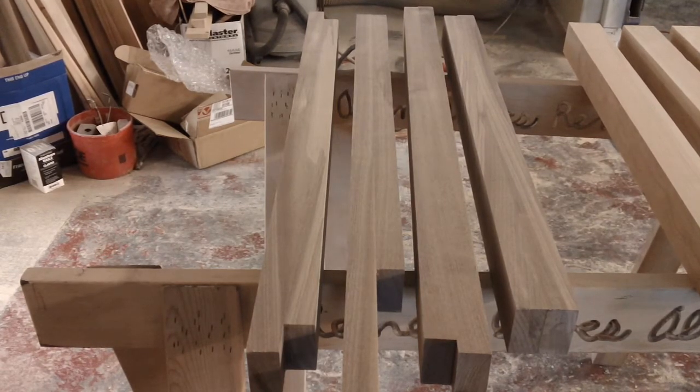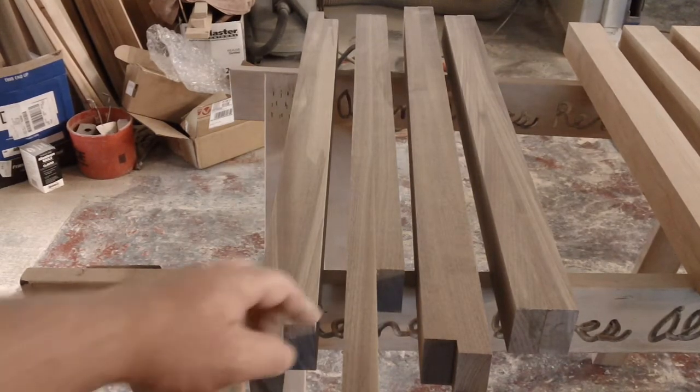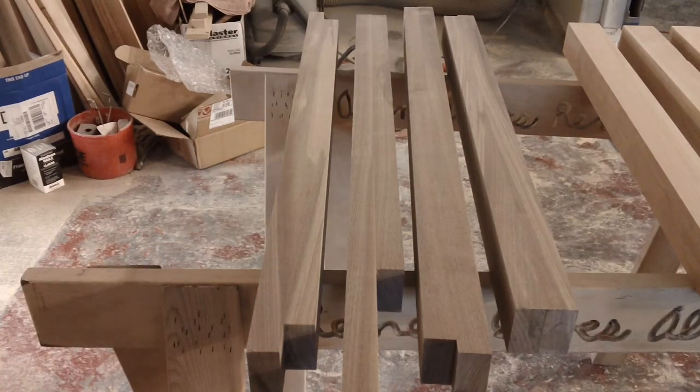The reason why is I can run the belt at a faster speed and it'll make a smoother finish, number one. And number two, when I cross cut these — when you cross cut across the grain, it splinters a little bit and that should clean that up a little bit.